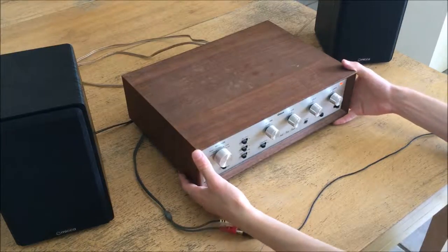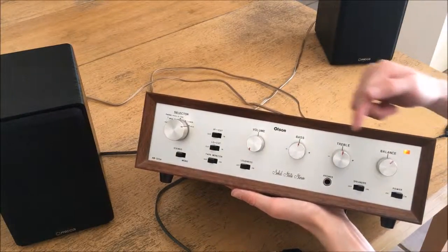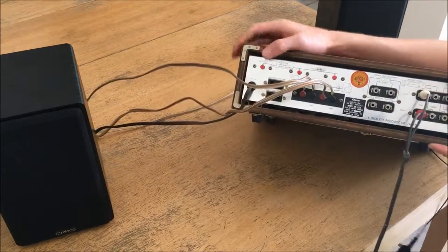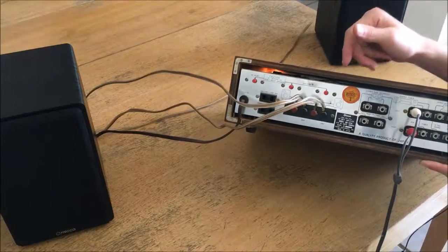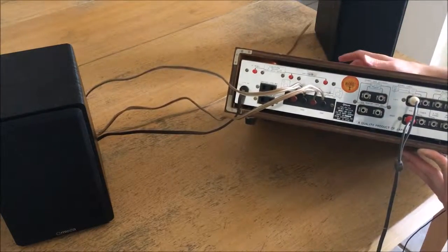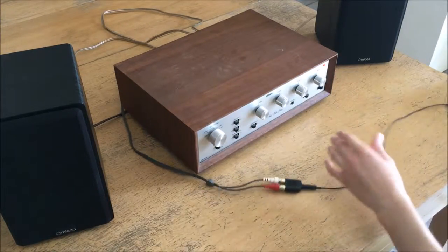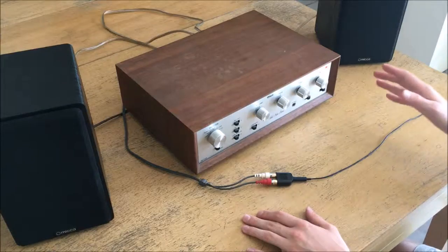I'll move the front panel towards the camera so you can see all the inputs — it's pretty comprehensive, with a lot of buttons and knobs. In case you're wondering about the power output, according to the label this is a 110-watt amplifier, presumably 55 watts per channel peak power, and it draws up to 160 watts at 117 volts AC. That's an oddly specific voltage but it's just the nameplate nominal input voltage. Pretty nice amplifier, certainly worth it for 10 bucks. In the second part I'll show you the inside and walk through what I plan on fixing.